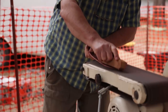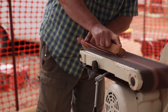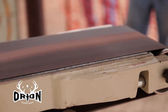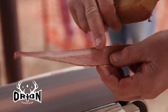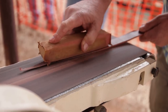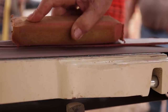I'm going to start skiving the edge with this tool here, putting pressure on the edge. There's a fine line of when to start before you burn the edge out — you don't want to burn the edge, you want to get it sharp. You can see right there it's already getting sharp, and you can see where I've taken off material. You want it all down here the same — sharp. Just do this as slow as you can. I'm on the edge here, using the edge of the belt.